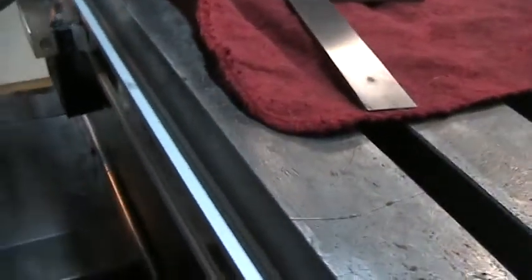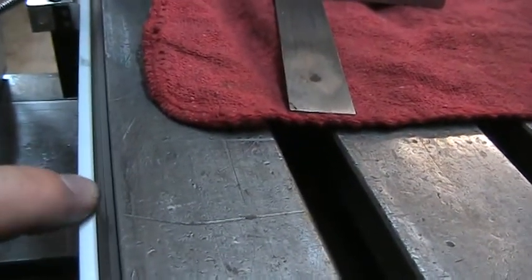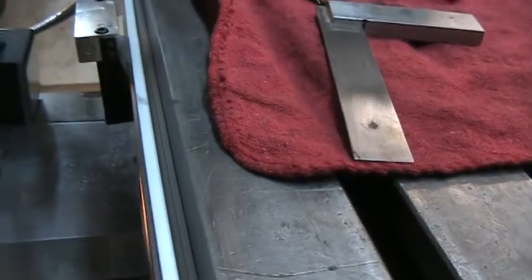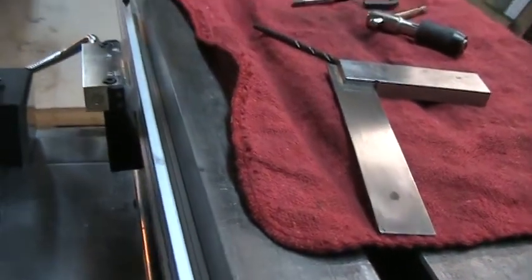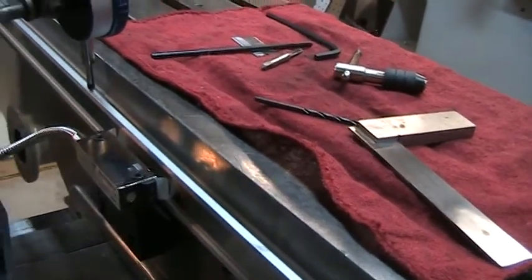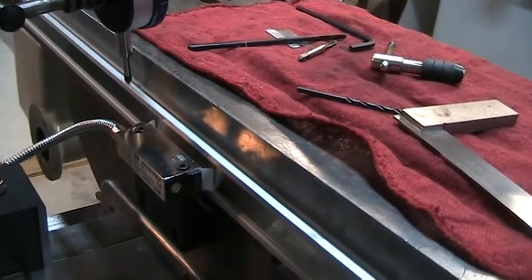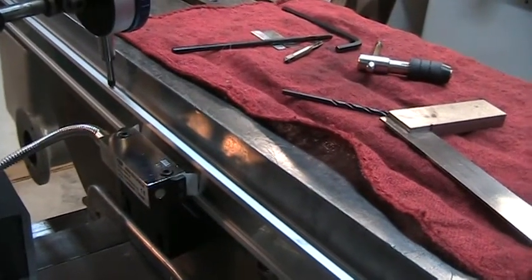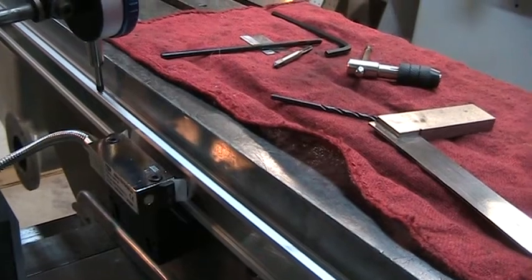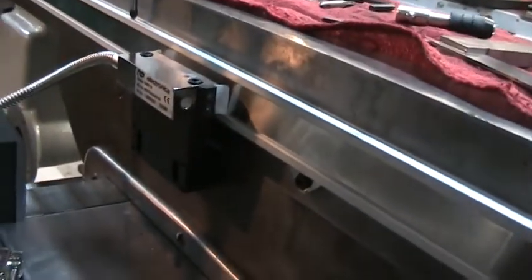It just kind of fits inside a groove — there's one for this side and also a groove on the top of the slide. At any rate, now we've got that squared away. The scale is pretty much on there permanently, and we'll concentrate on center punching the adjustment holes for the reader head and the bracket assembly.